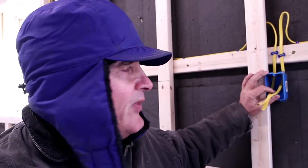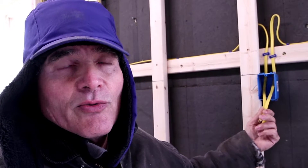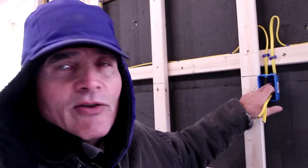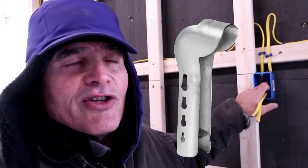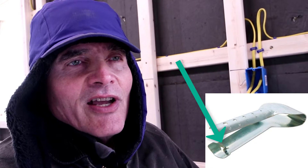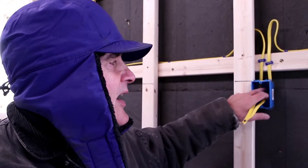What I'm going to do next is trim off the outer layer of insulation — the one that covers all three wires: the two conductors, which already have insulation (one black, one white), and the bare ground, which has paper around it. What I used to do in the old days was use a utility knife or an outer sheathing stripper — basically a little triangular tab on an apparatus that goes around the whole wire. There were a couple of times I think I compromised some of the insulation using that technique, so I'm going to use a proper tool instead.